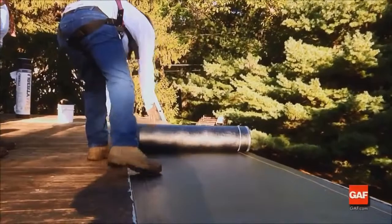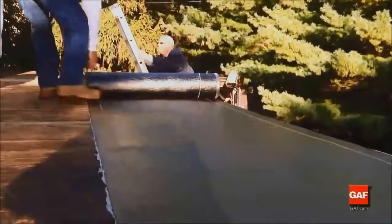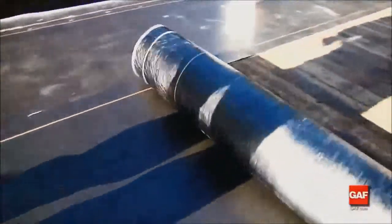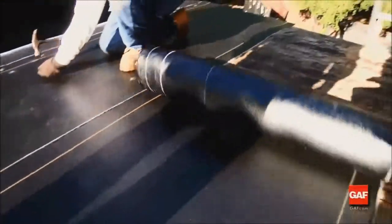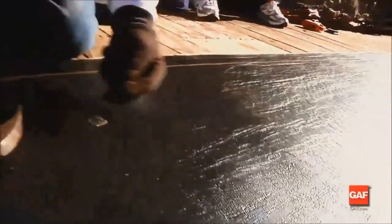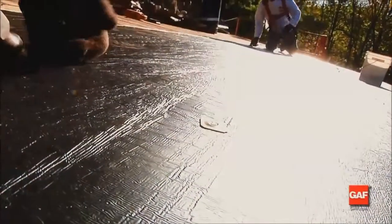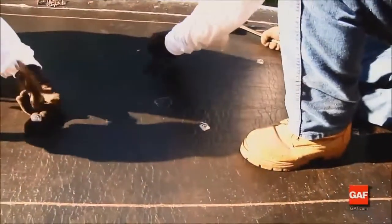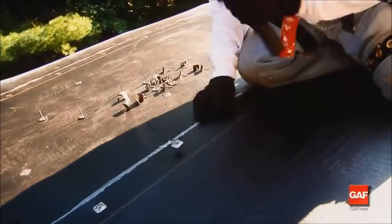deck. Liberty mechanically attached base sheet, also called Liberty MA base, is a 1 meter or 39 3/8 inch wide membrane that is surfaced on the top with a plastic film designed to maximize the attachment of other self-adhering Liberty membranes. This sheet is designed to be mechanically attached directly to the deck or installed above board insulation. For installation over board insulation, see the Liberty instructions.